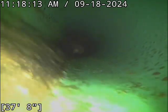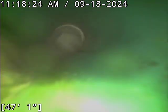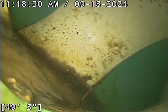And it's often because these two sections of pipe are being installed at a different time. The developer often puts in this green pipe, and then when the builders buy the lots, they often are digging them up and exposing those green pieces of pipe and then attaching the ABS pipe to them. In the process of doing that, if you don't get your math right on the money when you're grading things down to connect to that stub, or when they dig the stubs up and expose them, it's fairly easy to undermine some of the soil there or loosen it up. And then when you bury it again, it's not uncommon at all to get some standing water in those locations. So anyway, we're going to take a second look at that on the way out.